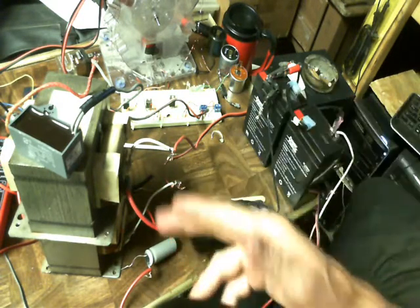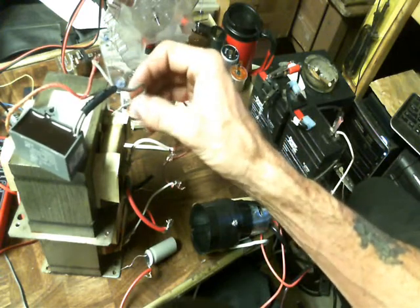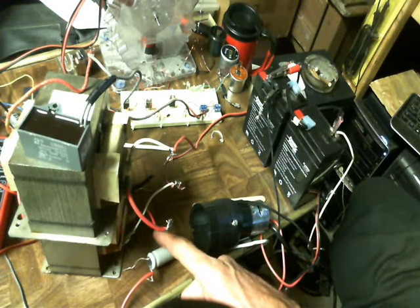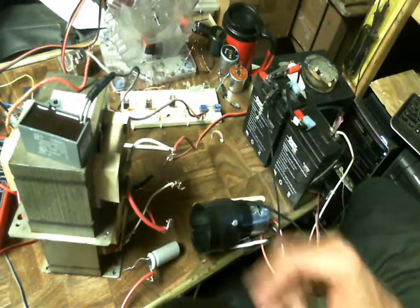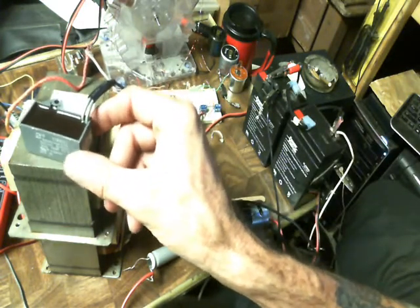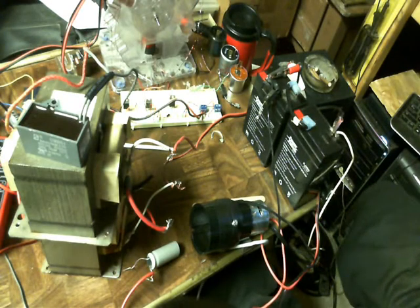And when that field collapses, it energizes the secondaries and gives you the high voltage spark. And you saw how whenever I discharged that over there it's charging that capacitor. This little capacitor down here I don't think it's any good, but it's still arcing through. These are really good capacitors for this kind of experiment if you ever happen to get a hold of them — they actually came out of like a microwave oven fan motor or some of the newer style fans. Anyway, I hope you liked the video folks. Peace and love. Stay tuned.